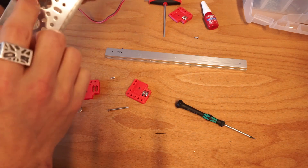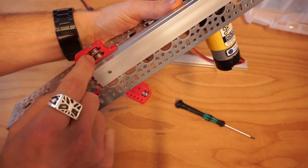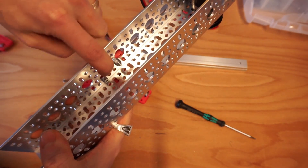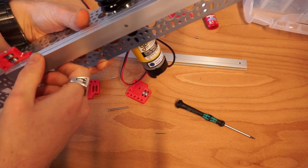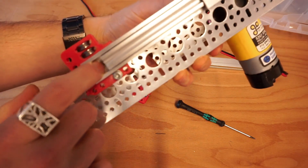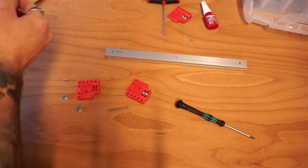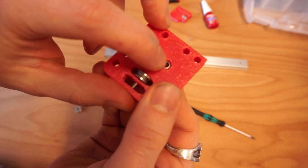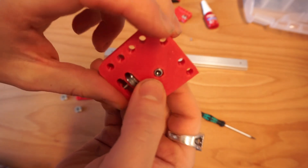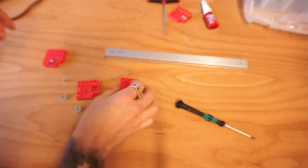On the inside I have an M4 bolt covered in a couple of different V-groove bearings, and that M4 bolt is what is actually attaching it to my system. These attach to the Misumi slide using your 8mm countersunk screws, and on the other side of the adapter is an M3 lock nut that just slides right in and holds itself in place because the bottom of this design has a hex head that fits right in perfectly.